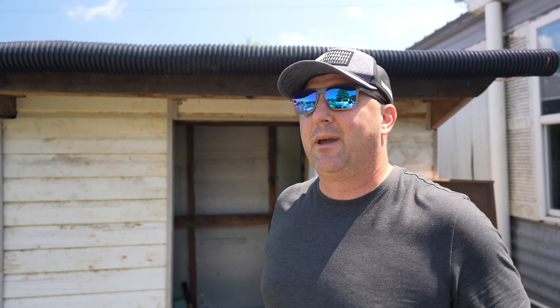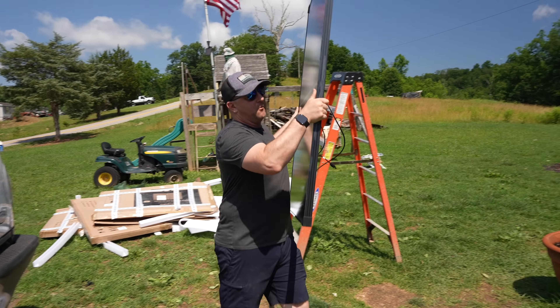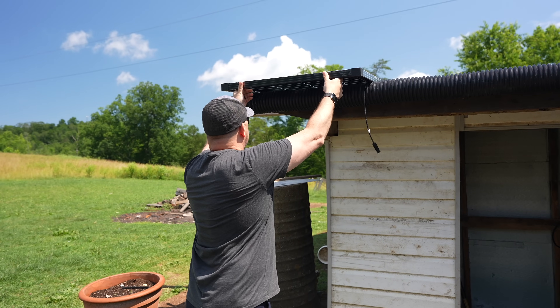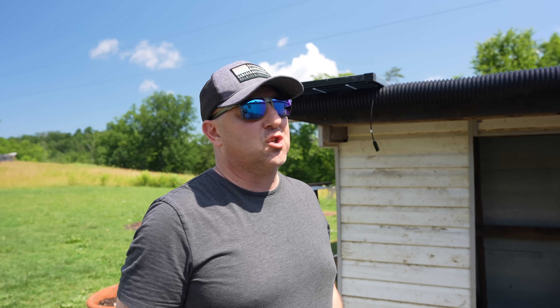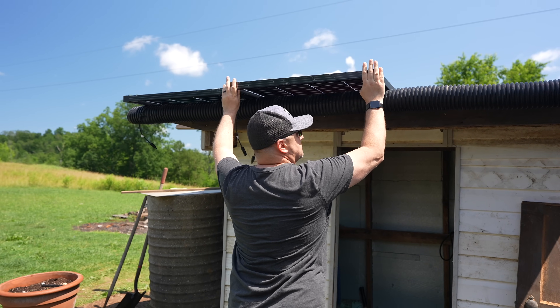The Mango Power E takes up to 2000 watts of solar power at 60 to 150 volts, so we're not in any danger of overvolting the system. The only real danger for this project is undervolting — if I don't set those up correctly, with only three panels I'm a little nervous that I may not hit the 60-volt output minimum. We'll go ahead and set these panels up and get them lined up. I'm going to wire them in series and test the voltage. If I'm hitting at least 60 volts — hopefully higher — then this system should work.